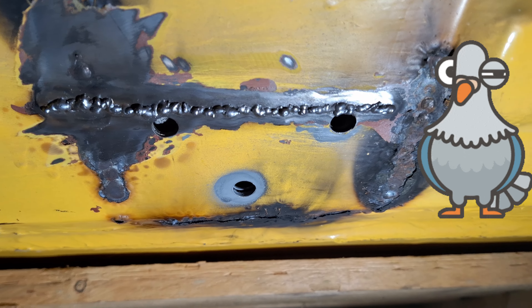Now I just need to take a tiny bit off the back just to square it up a little better so it sits flat on this edge. Then grind these edges down and put a little angle on these — I've found that you can weld a lot better when you've got a bit of an angle on this three mil steel. So that's the little chamfer I was talking about — it really helped me to weld a lot better and a lot neater on the other ones I did.